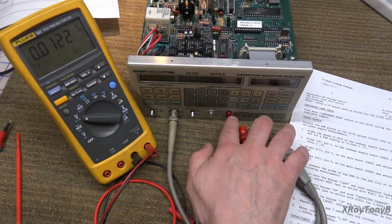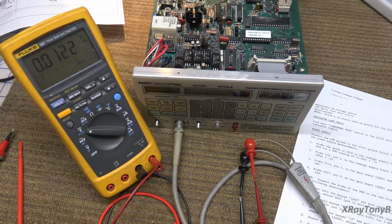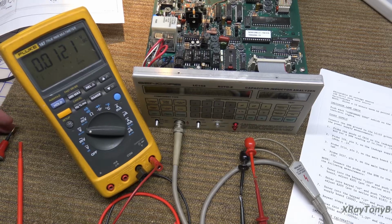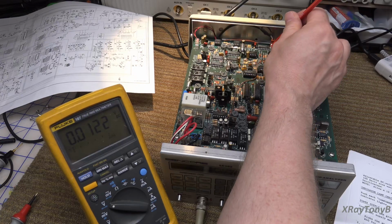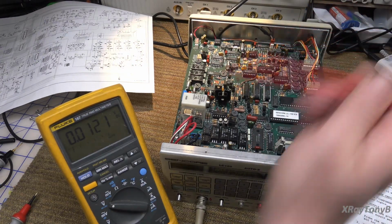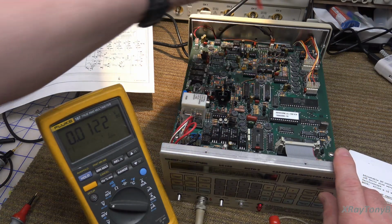Good, and this thing flashes telling us that there's high voltage going to be applied. And it says push the capacitor leakage button and adjust R201 for 97.5 volts. So let me find R201 before we do this. Okay, R201 is back here. It's this pot right there. So I'm going to hold this button down and adjust this.